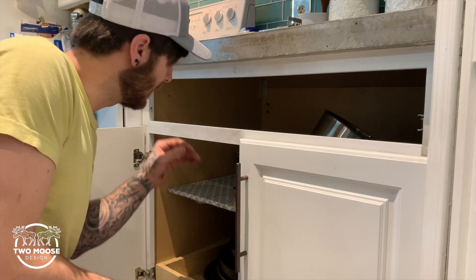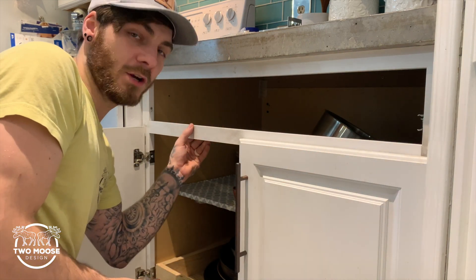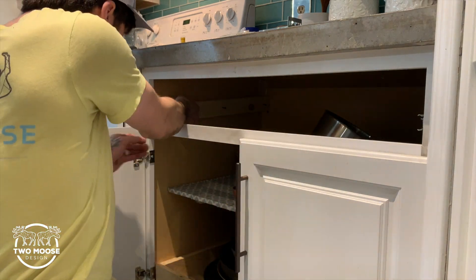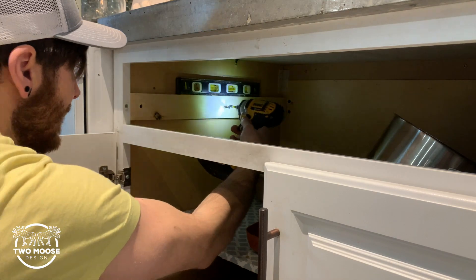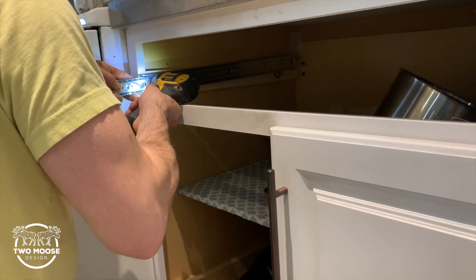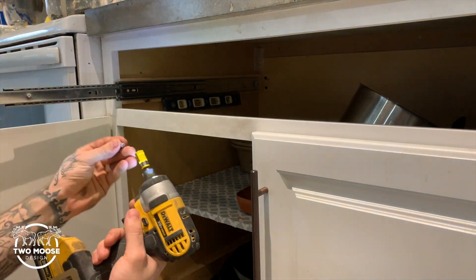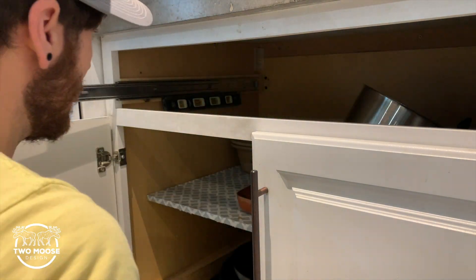The slides were pretty bad so we're just going to replace the whole shebang. I'm going to screw this in with some inch-and-a-quarter screws, making sure the piece stays level. Then I'm going to put the original screw back in so the height stays the same, along with three other screws into the slide. I repeated the exact same process on the other side as well.